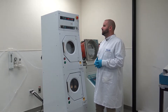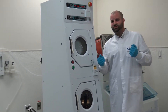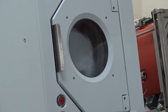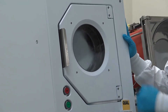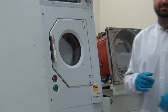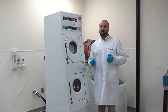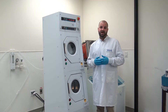We're about to slow down for our dry two in five seconds. Last step is final test, which is the configuration you see before you today. It will be placed in poly — this is how the SRD is going to look in our customer's fab. We've been running nice and smooth, so far so good. We have about three and a half minutes to go. In final test, we'll run over 50 various process runs with different speeds and times. We call this burn-in testing to make sure that it's ready for anything our customer throws at it in the fab.